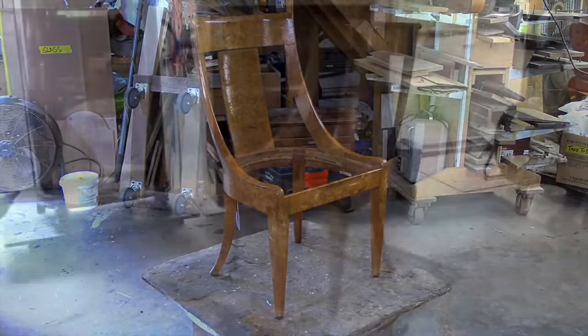I've got a good surface now on which to glue a new piece of wood. I've done some rough measurements on the other leg, and I really only need a piece less than 3 inches long. I've got a nice big cherry cutoff here. I'm going to cut a piece out of this. I'd say it's going to be about 2 inches wide and 3 inches long.